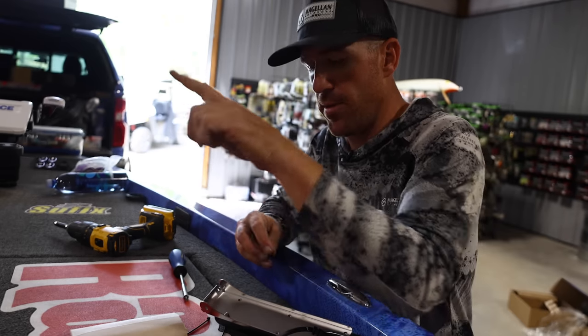There's a good dot right there — that's exactly what you want to see. Over on the left side on the down imaging, you can see the separation between smaller fish and the bigger fish. That is a really good image and exactly what you want. When you're not seeing a sharp bottom and it's really fuzzy, your angle could be the major issue. Seeing what I just saw, I feel really confident about where the angle placement is, especially at the speed we were going. My boat just doesn't lift that much at three miles per hour, so it's about right.